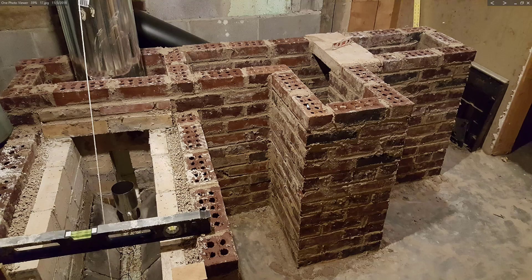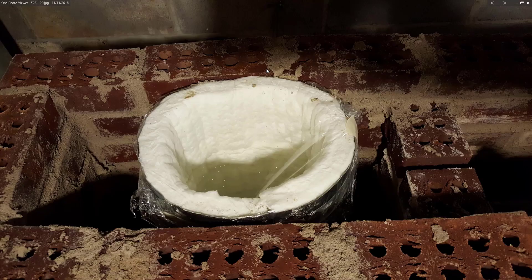I just needed to get up to six feet tall, so I kept going up and up. I ended up doing about two rows every evening for a couple of weeks. Now I'm up at about the five-foot level. You can see my one kind of tie brick — and at maybe the four-foot level I had to put another tie brick in. Now I'm up at the five-foot level.